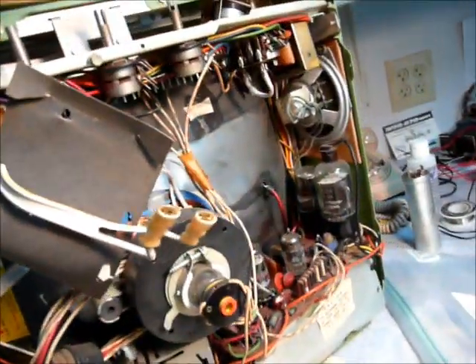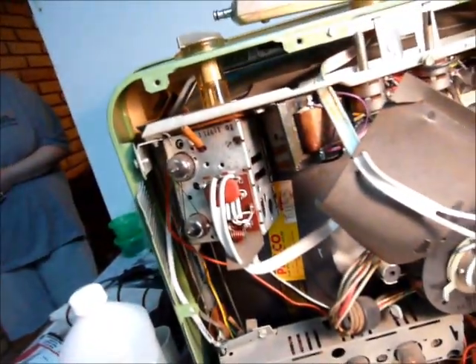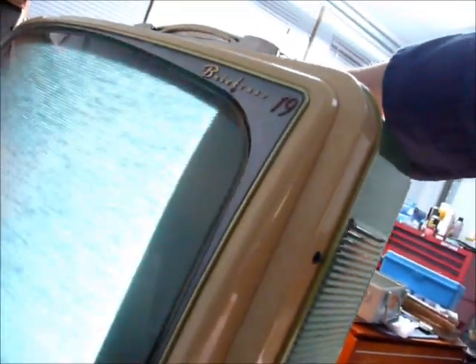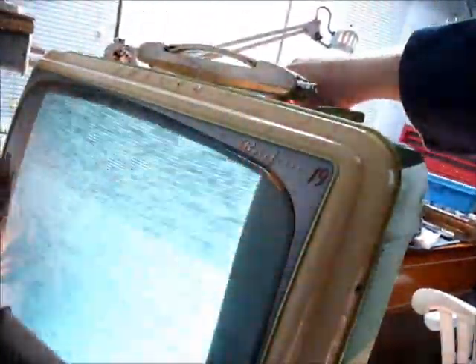The deflection is about full up and down — only about a half inch along the bottom, and I don't even have a signal hooked to this thing. It's pretty bright. I don't even know where the brightness control is. Now it's pulled in on the sides — about an inch and a half on the sides, varying with whatever control I'm working. I think that's the horizontal hold. It's varying a little bit with the brightness, so there's a lack of high voltage capacitance.